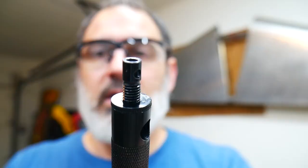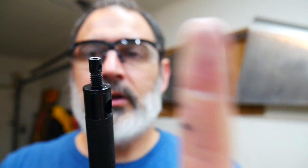I noticed that when I was spinning this previously, the drill bit was kind of wobbling around in a circle. What I did was just bend the drill bit very slightly, just enough to make it drill straight without wobbling. I'm not sure if it was because I didn't drill straight enough into the shank or if my drill bit was bent — I don't know which one it was — but it was vibrating quite a bit. The first couple that I did bent the drill bit and then suddenly it worked fine. Just something to think about.